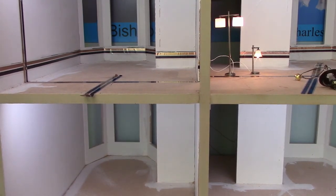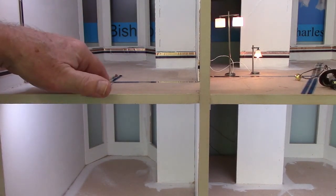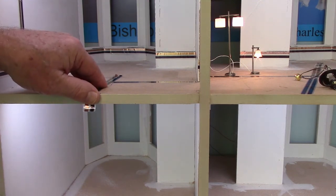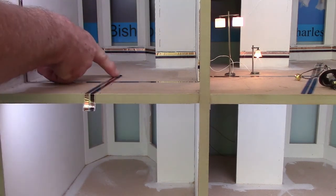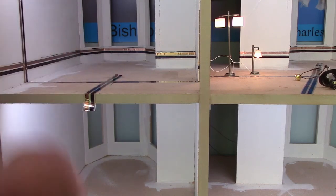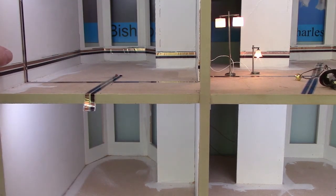Now we can take the micro jacks with a tail and put the bare wire coming up through here, lay it on either side of the tape, and then solder directly to that. And that'll make those micro jacks live, that we can turn around and just plug in our outlet or our lamp that we previously wired.